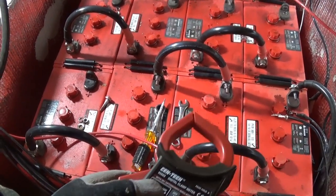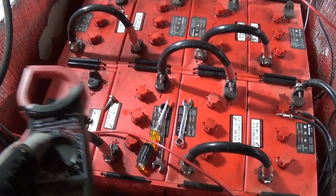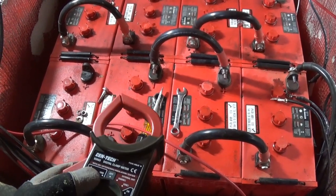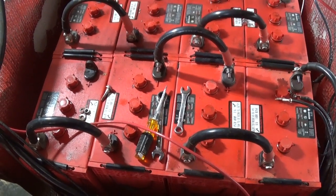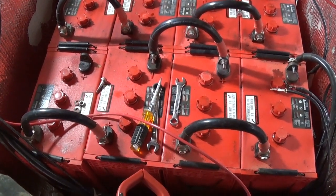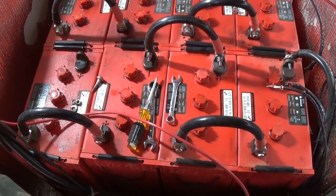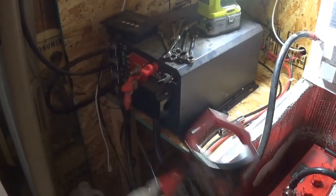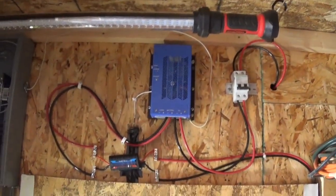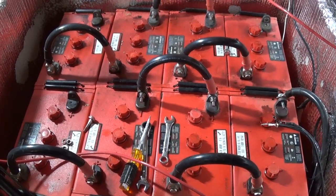These four are still hooked up in series — positive, negative, positive, negative — giving me 6, 12, 18, 24 volts. Each one is 460 amp-hours, so I still have 460 amp-hours, minus that 50% usable limit, giving me about 200 amp-hours available. I'm going to hook these up and test it — see if it holds the charge better than all eight connected. If it does, I've bought myself some time until I get the lithiums. That Xantrex 2000 inverter gets replaced, charge controller gets replaced, more solar panels and a rack — it's going to be a big upgrade.